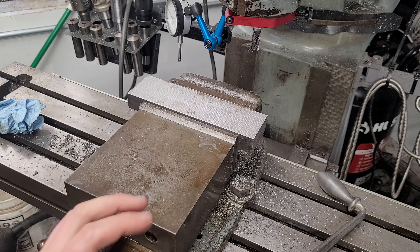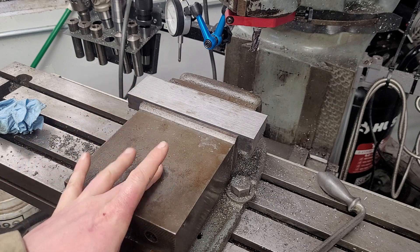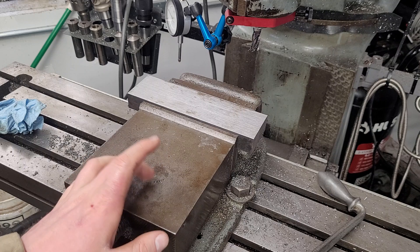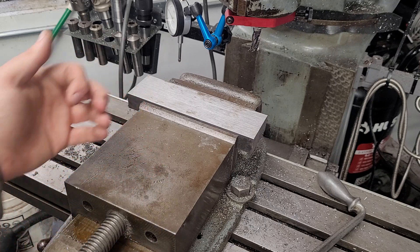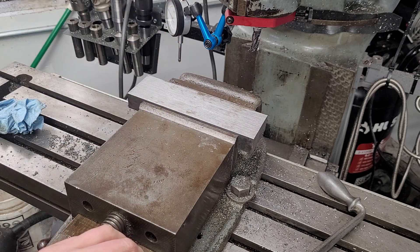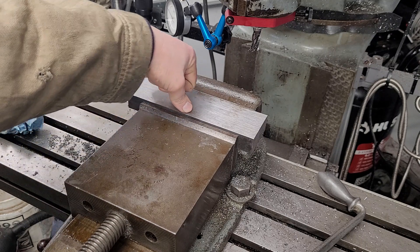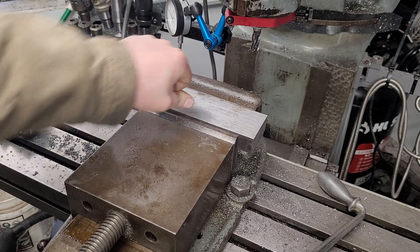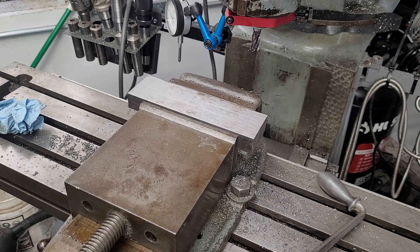I hope this helps if you're having any struggles with your vise. You can still do good parts on really old vises, it's just easier on a Kurt where jaw lift isn't an issue. This vise will move between two and five thousandths depending on how you tighten it. Interestingly, if I keep my thumb here and put a little downward pressure while tightening the vise, that does seem to help. Thanks for watching — like, comment, subscribe, and have a lovely rest of your day.